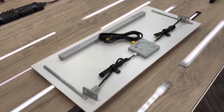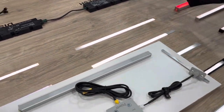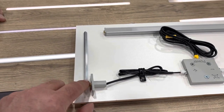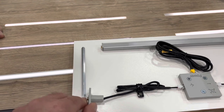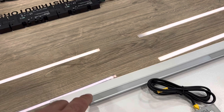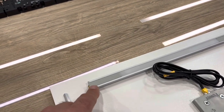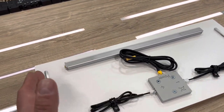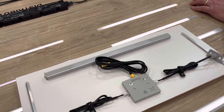This is the power setup for the light and adjustable shelves - it goes on the top or bottom of your cabinet, and runs over to touch the aluminum strip that powers the side of your shelf. AVO will make these the exact size you need. You route out the side of your shelf, pop them in, and run your wiring. This connects into a regular power system.